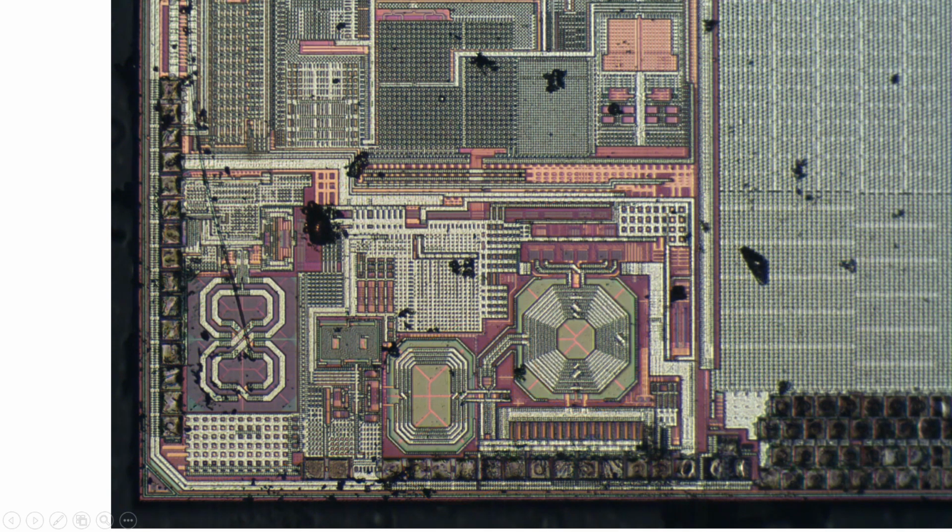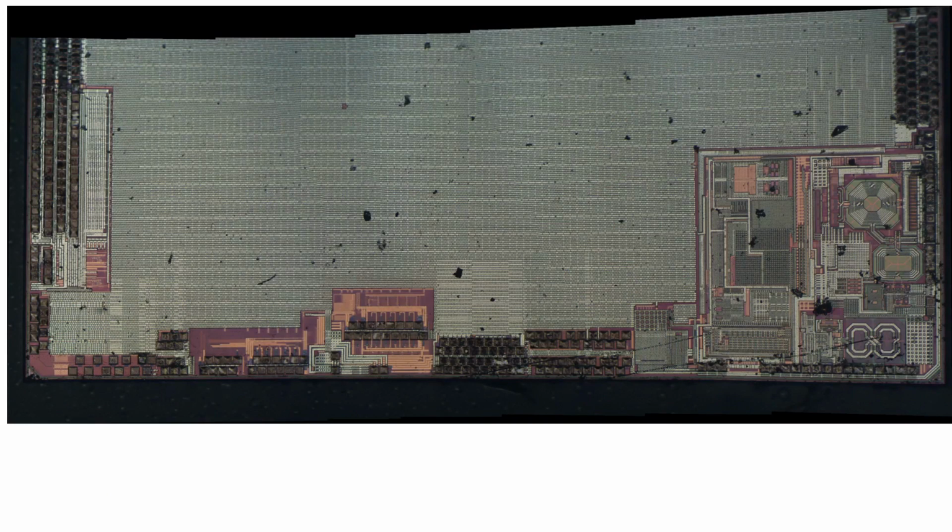And if we come back up, what else can we see? We can see some of the I/O to the DRAMs and to the NAND coming down on this side of the chip here. But to go further, basically what I have to do is now known as a metal strip, and that takes a bit of time. But I have to remove the metal here for us to figure out what's going on in the chip. And I think that's going to be worthy of the next video. With so much silicon on this chip, I think this is going to definitely be a multi-parter.